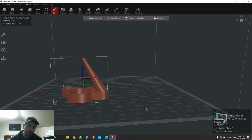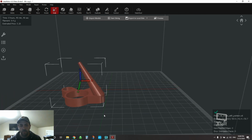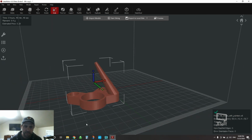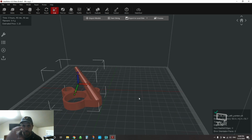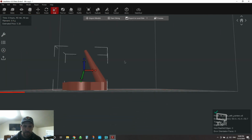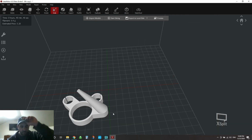So, I've got a laser out in the shed quarters, just one of those little K40 lasers, and I wanted to add a new air assist nozzle, and this is the nozzle I went with. Obviously this is upside down in relationship to how it fits on the laser, so it prints flat. You've got a hollow tube coming up to direct air out this little tiny hole. And these two holes here are to fit a laser pointer if you want.